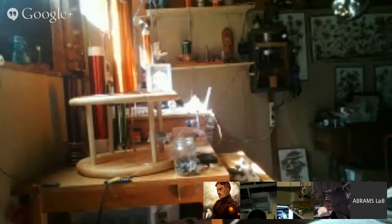And then the bottom of the Tesla coil, on top of the pancake, the first wind is connected to the earth too, which is really strange. It's kind of like what I've done before, but this one works great. It's better. It's strange because that tall tower and the small pickup tower are not even close to being the same number of turns or size of wire or anything. They're totally different. One's 3.5 or 4 inches, and the other one's 2 inches. It shouldn't even resonate with each other.